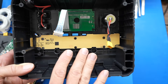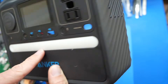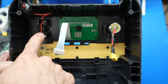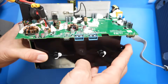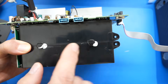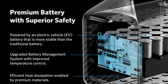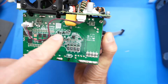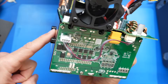Now that we have a good view of everything, let me explain what some of the parts are. Right down here is the LED light bar you can see on the front. Of course there's the 12 volt car port, the LCD screen, and the AC outlets. The big thing I want to point out in the main part of the power station is this plastic area right here — this is where all the batteries are. There's an illustration on Anker's website showing there are 20 individual cells in here, all adding up to that 256 watt hours of storage. On the side is a printed circuit board — this is the battery management system, which handles all of the safety and the charging and discharging of the batteries.